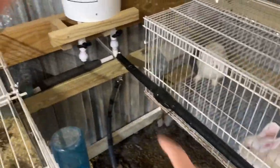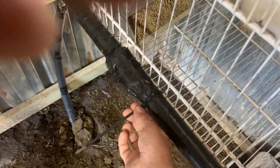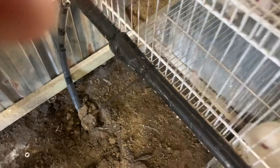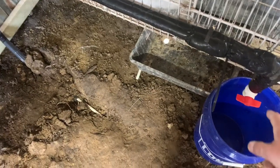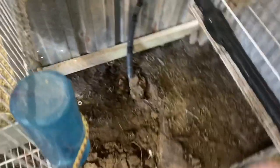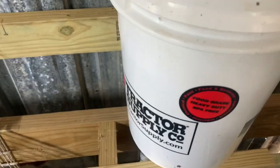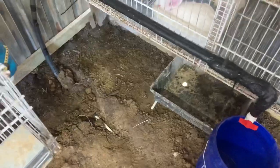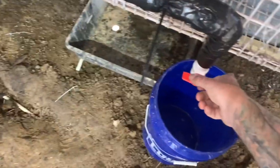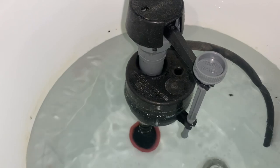We come back in, connect it back to the union with the valve still off, and zip-tie the line to the cage. Now I'm going to open the water and make sure nothing's leaking. Now it's our gravity-fed system — I can hear the water. It's bubbling, letting me know water is going down in the line. The line is full; we start flushing it, and the fill valve is keeping up, putting new water in.